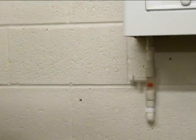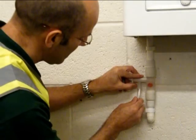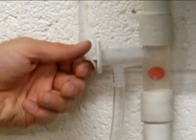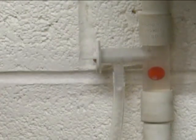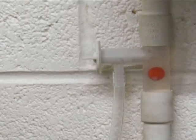When this situation occurs, we have to apply the hose to the tail. Once the hose is attached, we turn on the tap, the condensate drains into a bucket or other receptacle, and the boiler will carry on working.